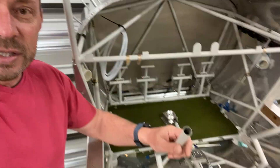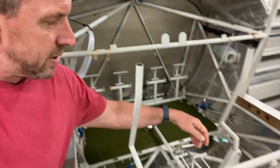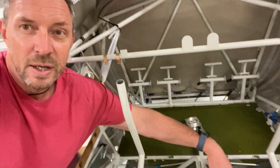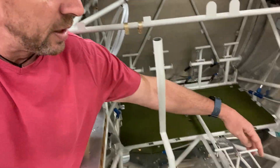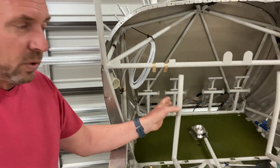I spent quite a lot of time yesterday taking the controls right out. The problem was they were very free laterally for the ailerons but binding in pitch. I tried shimming underneath and various other things, and in the end I took them out and could see the problem: the mount down here is not square — it's on a slight angle. When tightened up it was pinching the bushings and compressing them together, causing the friction. I've now opened those holes out a little bit larger and allowed the AN4 bolts to sit on their own angle, and that's taken most of the friction out. It will actually fall forward of its own accord at the right angles, so I'm pretty happy with that.